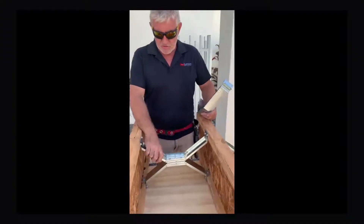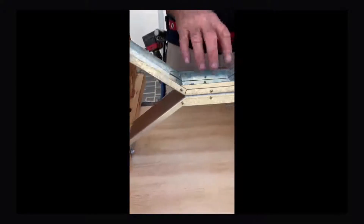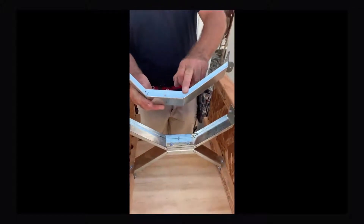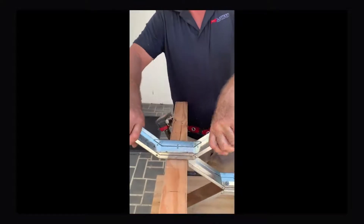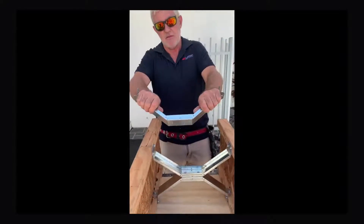This is the Bermond floor lock system. This one's the under lock, which locks underneath inside the i-joist. They're screw-fixed in the middle, so they come in two separate parts like this. We have this fillet piece in here, which gives you so much more strength — without it, the thing can end up rocking and rolling in an earthquake. So that's there for that purpose.